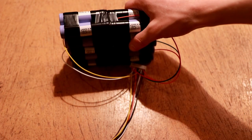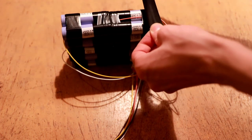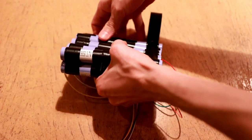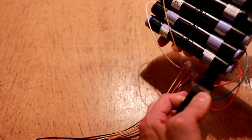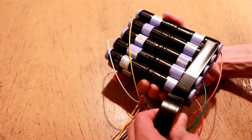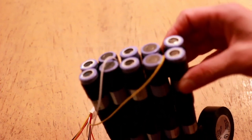Now as you can see I have all five of these batteries connected together in their four-cell configurations and before I begin soldering the end caps together I'm going to wrap each of these in another layer of tape. This is going to make sure they stay together during final pack assembly and remain properly aligned and in place. I'm going to wrap so that the tape goes underneath all of the balancing leads so I don't accidentally make it difficult to move the balance leads where I need them during final assembly.